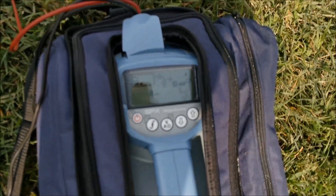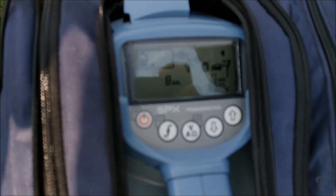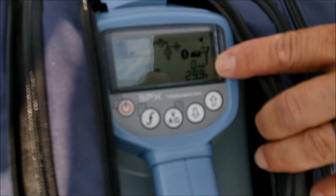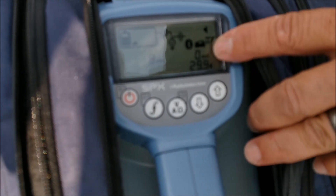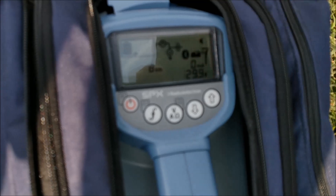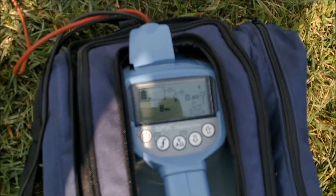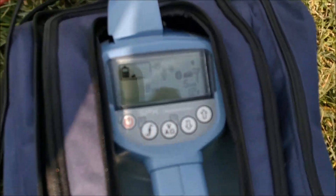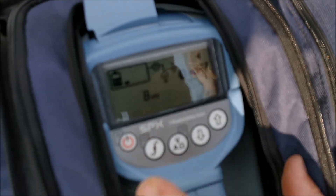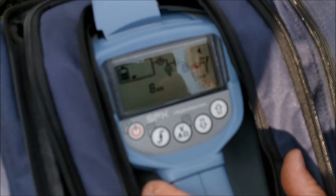I'm just going to unplug the cable from the wire real quick, and you can see I now have 30 volts — it's kicked in extra voltage to try to substitute for the lack of continuity on the wire, and I have zero milliamps. Zero milliamps means you're not going to pick up a signal with the receiver at all. We want milliamps to go down that line because that's what we're using to locate. Five milliamps is enough — on this tracer wire it will go about a city block.